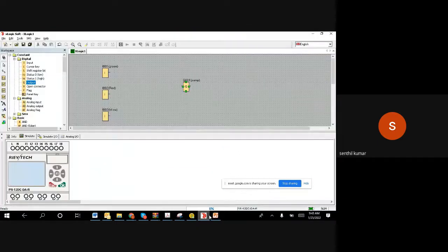And we configured the digital input and digital output, right? So now we are trying to do the programming part. The IO part we have done. The logic part we need to develop, right? The requirement, as we said, is that when you push and release, the pump must keep running. Though you release it, it must keep running. Generally when you push the button, it gives a signal, and when you release it, it goes off.